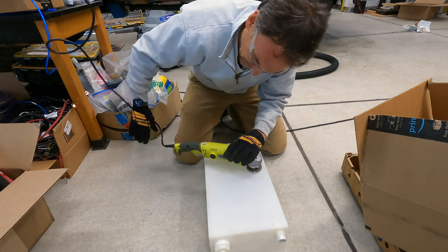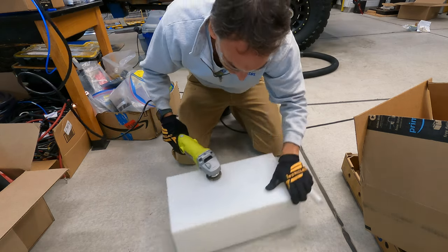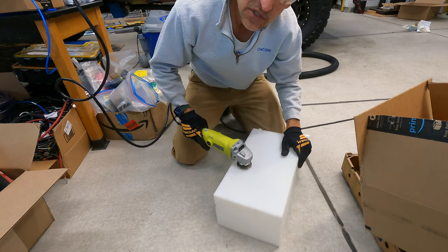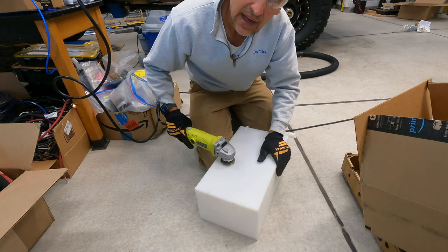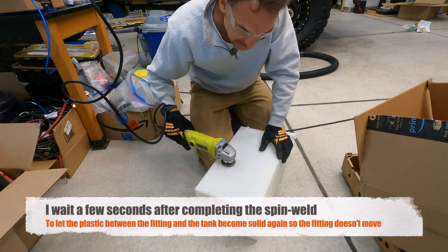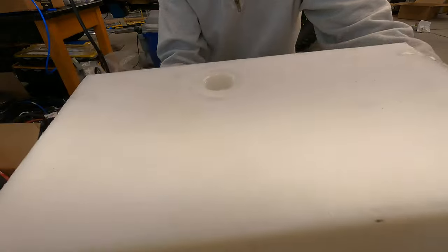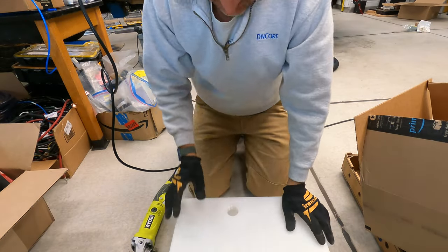Generally it's very safe and quick — it only takes a few seconds with something spinning this fast, so you've got to be very quick. I'm going to set up my tank so that my grinder is off to the side so I can adjust my height, watch over here, and put some pressure on the top to keep it flat and level. Just watch until it melts in to a good point, which should only take a few seconds. I'm also going to brace it with my legs and knees so the tank can't wobble or move. Just do it for a few seconds and then stop. That's a perfect spin-on weld fitting — it looks primo, perfectly flush with the level of the tank, solid and pretty even all the way around. That's going to work great.